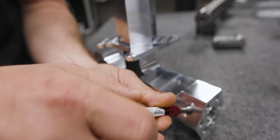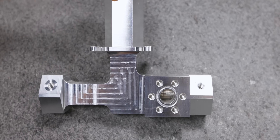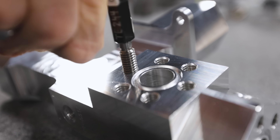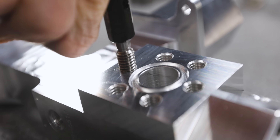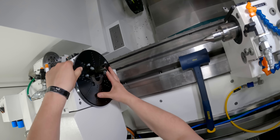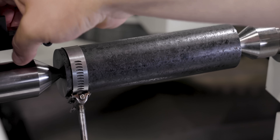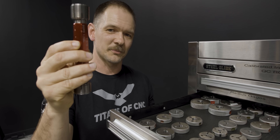So how do you go about manufacturing a plug gauge? Well, it's a part like anything else, and although this is a high precision inspection item, it does have tolerances that if you hold, will make an accurate plug gauge. Chris is going to take you through that process from machining the OD, to the pitch diameter, and all the features of this plug gauge. And when he's done, he's going to bring it back to me, and I'm going to inspect the part that inspects the part.